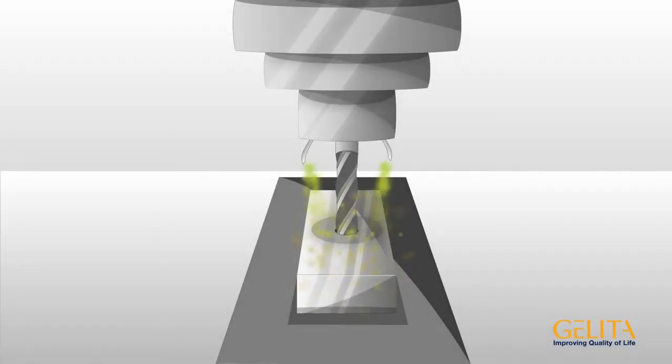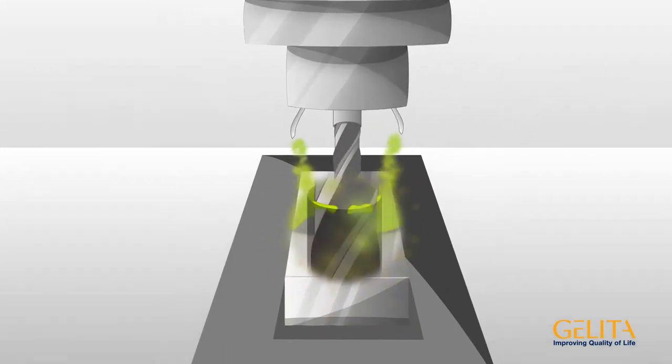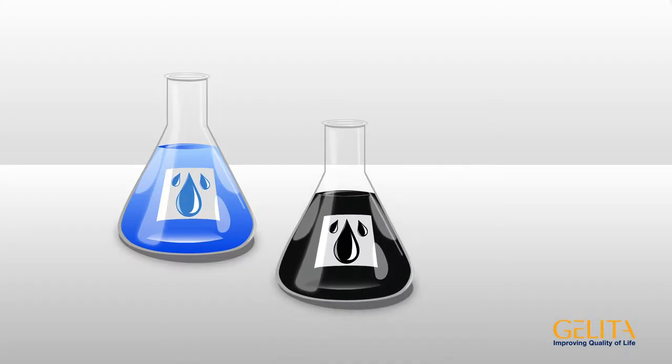In metalworking, cooling lubricants are required. For example, in milling, drilling, and grinding applications, tools and workpieces must be protected from heat and wear. Most cooling lubricants consist of water for cooling, mineral oil for lubricating, and emulsifiers for stabilizing the water-oil mixtures.